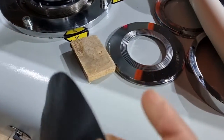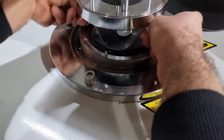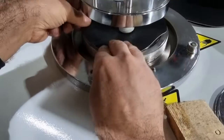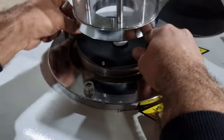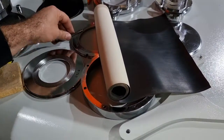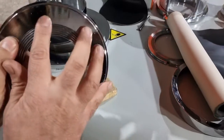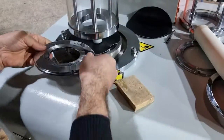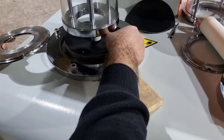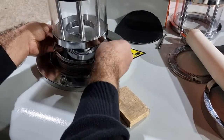This punch is needed for restricting the twisting of the rubber membrane during assembly of the sample piece. It comes to this pin — the pin will restrict the membrane from twisting when you tighten the ring. Put the appropriate test ring with the specified test area.